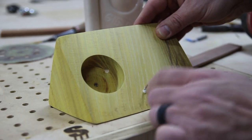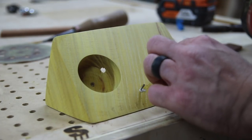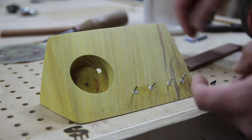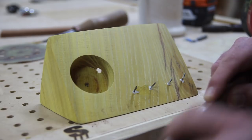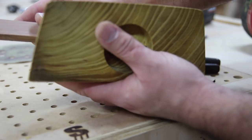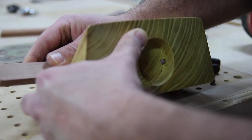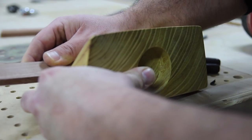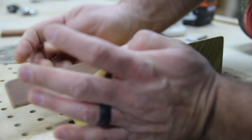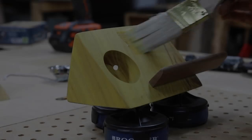I've got four nails placed in the block. Now all I've got to do is put some glue on the back side of the shelf and place it over these nails. Because I measured everything, it should slip right into place — and it does. I have a little bit of trouble with one because one of the nails is slightly bent, so I just bend it back as I'm pushing the shelf on, and then it just goes right on. It worked really, really well — better than I expected.